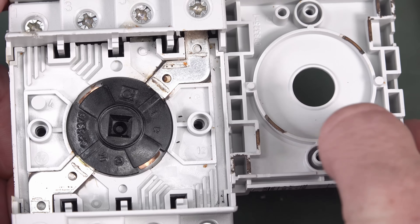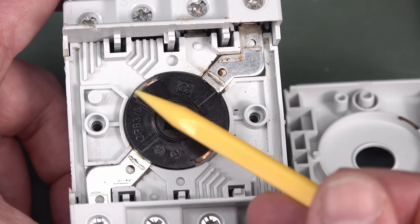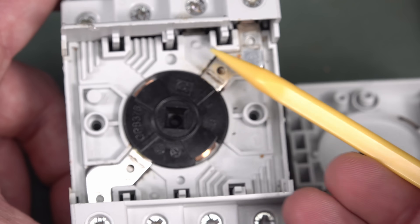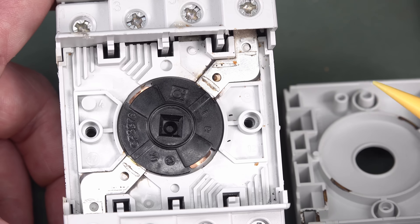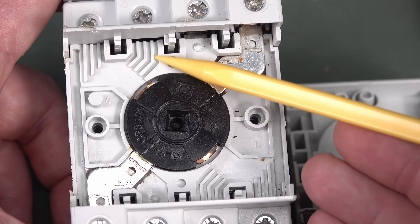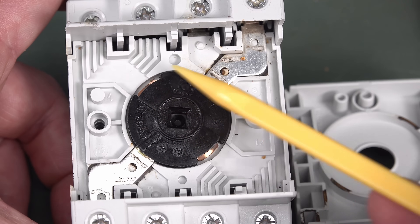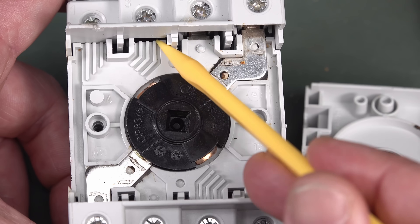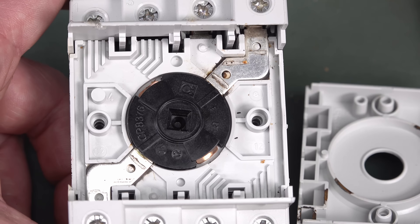You can see how this arc extinguishing happens here — it's all in the physical design of the plastic. These are what's called arc chutes, because they're like little chutes shooting off like this. You've also got arc barriers here as well. And you'll notice that the top of this has a ring going all the way around it — that is to contain any plasma arcs. So the plasma really has nowhere else to go but through this open gap here. When you switch this thing off, the arc wants to maintain — it's going to generate this high voltage plasma field. It basically has this open area, goes through here, then down this path and this one and this one, and it just slowly dissipates out. That's how the plasma escapes — confined within that switch mechanism by that plastic, using the arc chutes and arc barriers to channel and extinguish the flow of any potential plasma arcing.